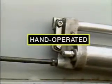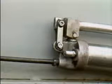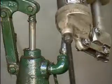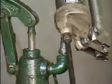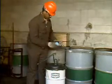One of the most widely used types of lubricating devices is a hand-operated grease gun. Many grease guns can be filled directly from a drum through a fitting. These are called bulk load grease guns. Grease is pumped into the gun with a device called a grease gun filler, often simply a hand pump installed on a grease drum. The outlet of the hand pump is attached to the fitting on the grease gun and the handle is pumped. When you start to feel resistance to pumping, the gun is full.